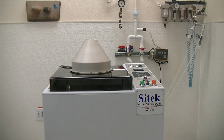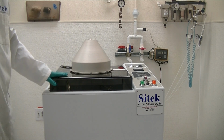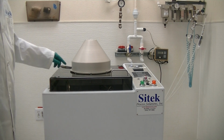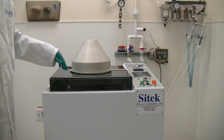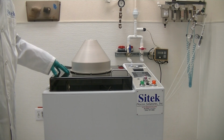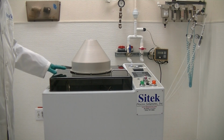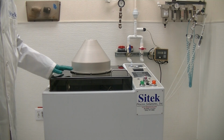Also, and I'll give you a better view in a second, this system has 2 dispenses besides the high pressure and the N2 blow off. You'll see the brush scrub head has 2 dispense nozzles. You can't actually see them because they're integrated into the head, but in the process you'll see them. And the customer has the choice, which they haven't told us, if they want to do some kind of surfactant or some kind of other chemical that is pre-wetted on the wafer during the scrub process.